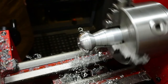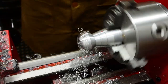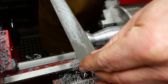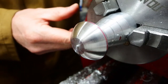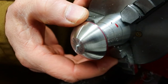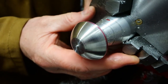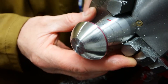And following that, I'm just going to try and use a very large tooth file to bring it down to approximate dome shape, get rid of those steps. It's a special file for aluminium, not an ordinary file that would get clogged up. But after a certain point it started to show some chatter marks and facets in the larger diameter of the dome, so that wasn't going to work. It wasn't going to work to a finished part anyway.